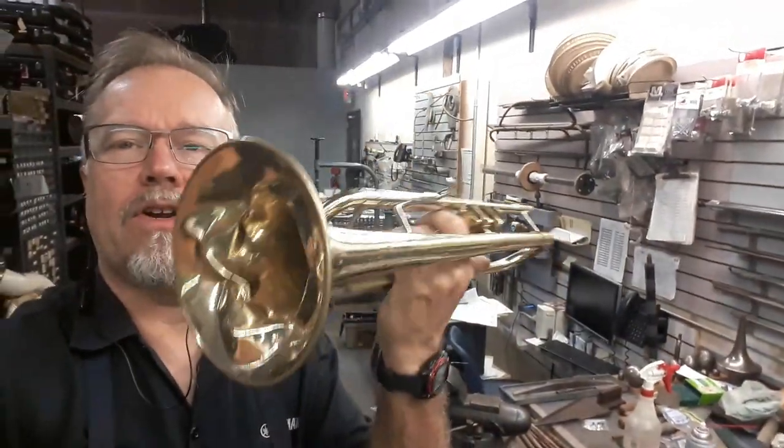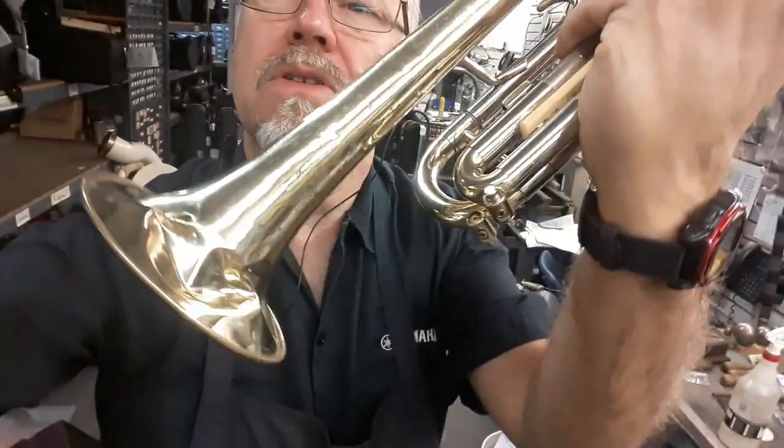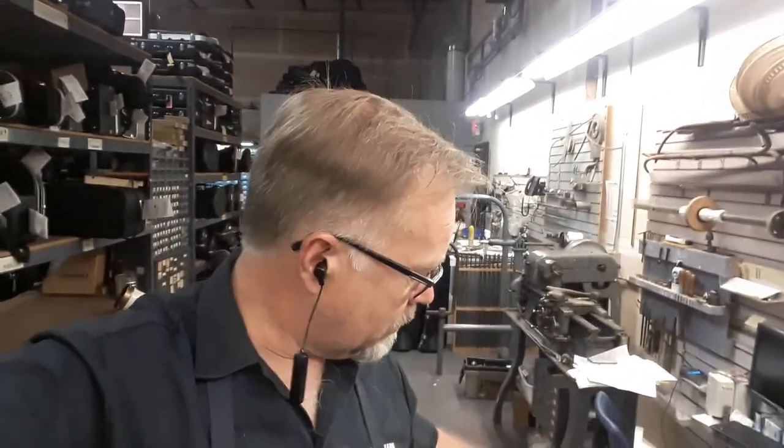But I think I have time to do one for you, and I think this one will be really interesting because we've got a very crunched bell here. You're all probably familiar with that trombone crunched bell video I did a couple of years ago — it's got a lot of views and I'd like to get that over a million views. Anyway, this trumpet — unlike that trombone — we're not going to anneal the bell, we're not going to refinish the bell. This is a student line horn from a high school. I had to re-solder the lead pipe, it needs to be chem flushed, and we need to put a new third slide finger ring holder on this. So we've got a number of things to do, but I want to show some bell work on this because it always provides a good visual and some good metalworking technique.